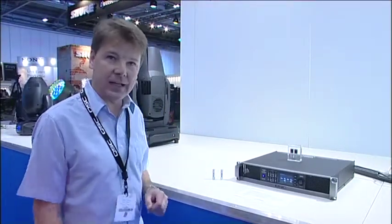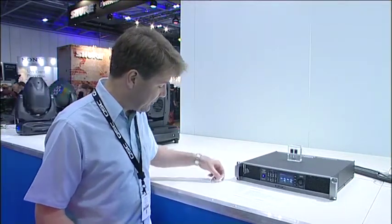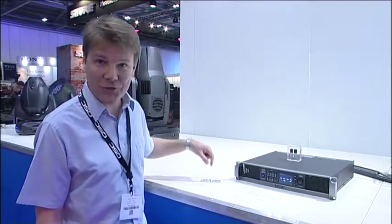We can make an analogy with batteries here. A two-channel amplifier would be just like two batteries, and you could use one or the other independently. Or what you can do with every amplifier is put them in bridge mode, which gives you extra voltage capability. In battery terms, it goes from one and a half to three volts, but the current capability is the same, because you can only have the maximum current that can pass through one battery or one amplifier channel in the circuit.